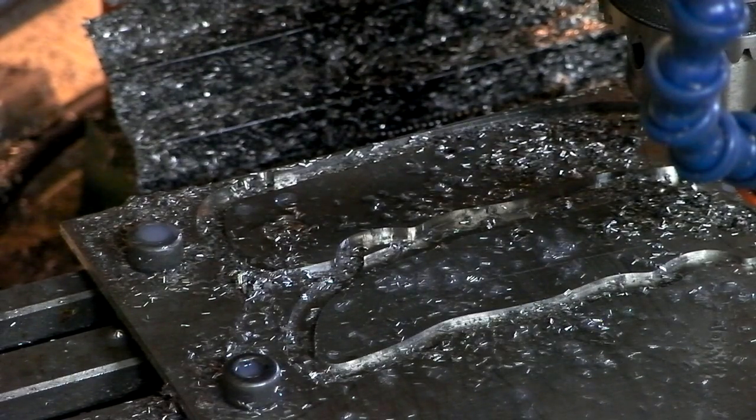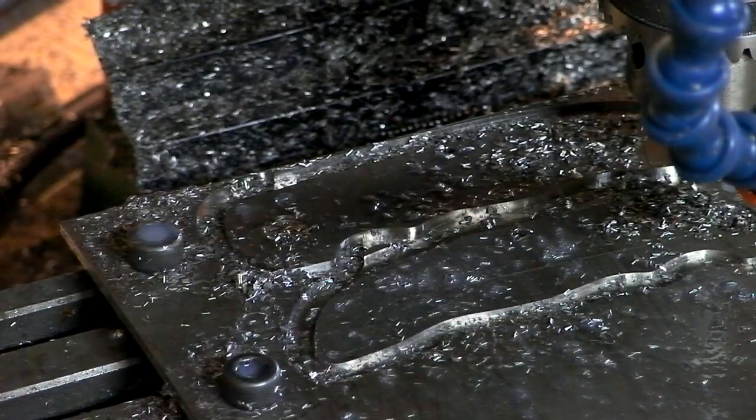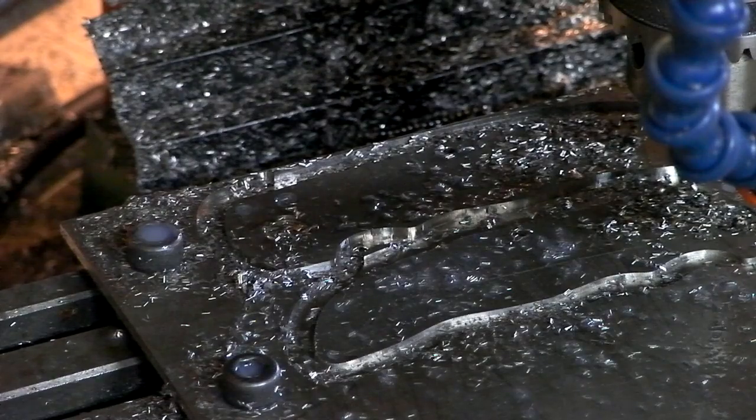All I have to do is zero it on a known location, which is one of my reamed pivot holes. I know exactly where that hole is in my CAD program, so if I zero on that hole, I know where the machine is, and then I just pick up the program where I left off. I'm profiling it with a quarter-inch end mill. Yes, I'm still holding it with a drill chuck, and I don't want to hear about it — this is just how I wanted to try it. I will be using collets, so all you machinists will be happy. It sounds terrible while machining — three inches per minute is painfully slow. But it works, it's cutting. This is proof of concept.